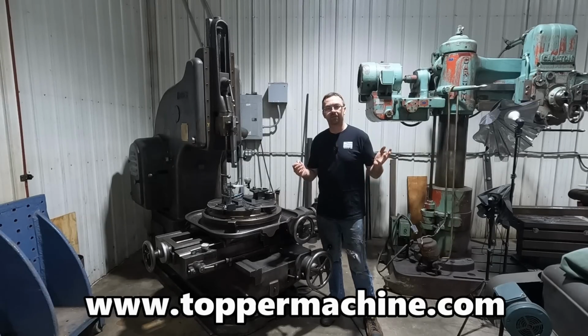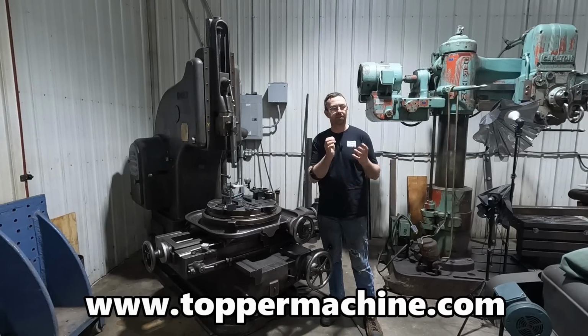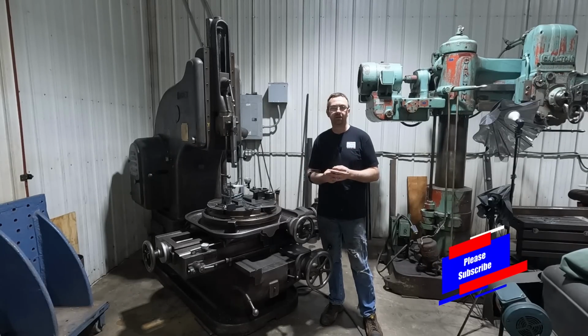Well, I hope you enjoyed this quick video. Just an easy little project you can do to improve the lifetime of your machine. Works on engines, works on metalworking machines, works on anything with an oil system. Just a great addition that a lot of manufacturers don't do. These magnets I bought off eBay. They're rather inexpensive, I think it was like 30 bucks for that whole stack of them for this size. And I bought some big ones and put them inside the headstock of the Lion lathe, just trying to improve the longevity of my equipment by collecting all the fine material that wears over time inside the oil systems.